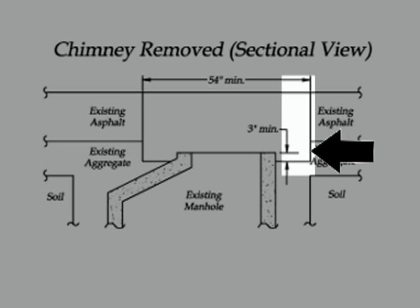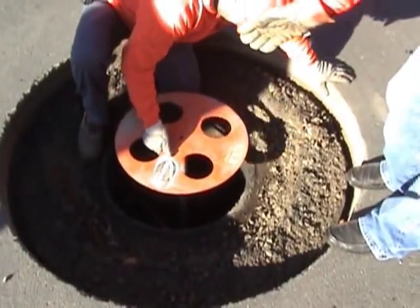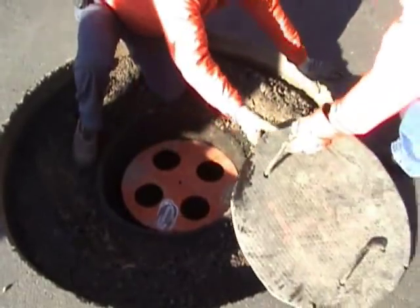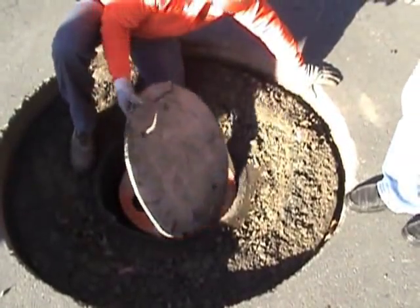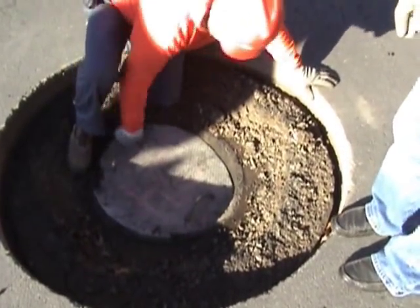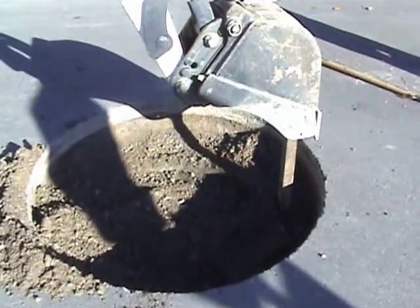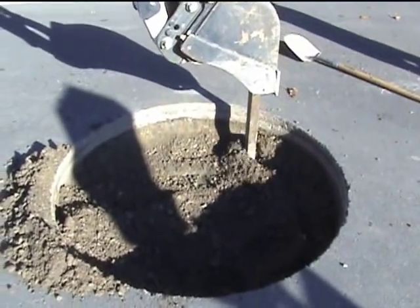It's very important to get a full vertical cut even below the asphalt pavement — the existing aggregate has to be trimmed straight down. That's what the MR manhole cutter extractor allows you to do. You'll also notice this three-inch over-excavation below the top of the cone, which is very important so that we have drainage away from the bottom of the concrete repair.